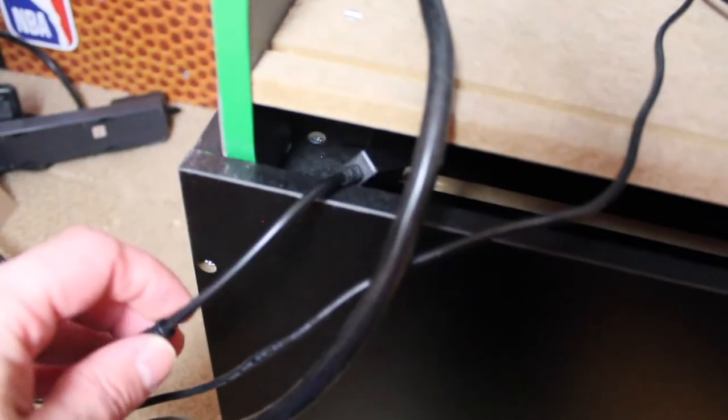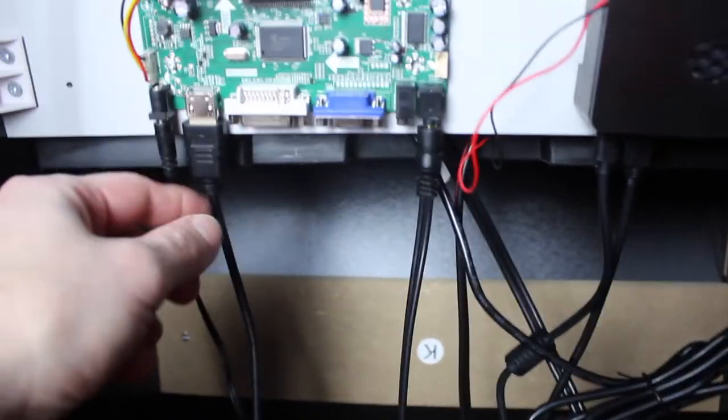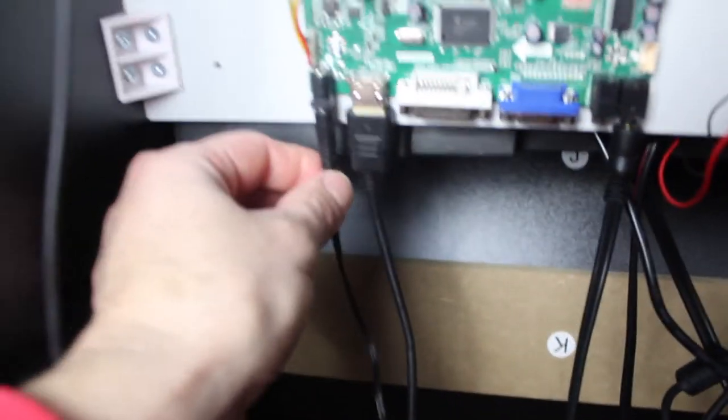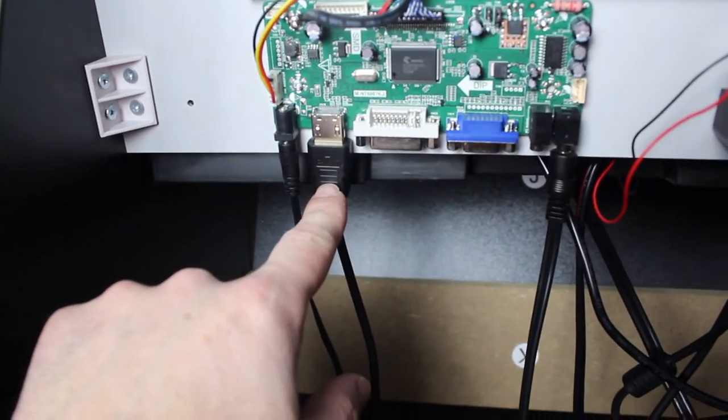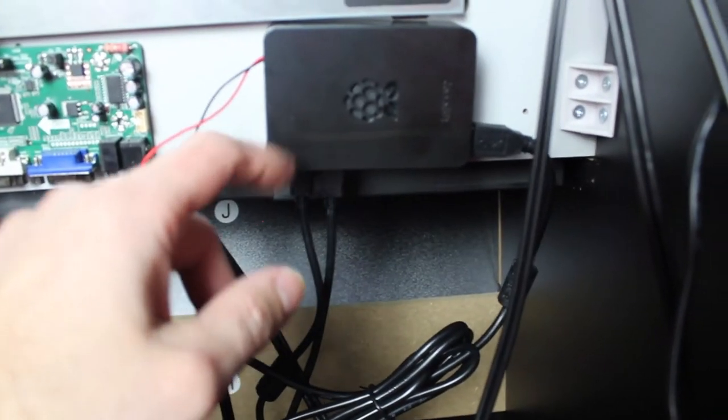Looking in the back — this is pretty similar to ETA Prime's setup. Down here is the cable from the light-up riser and the little display driver board — I'll put a full parts list in the description. Here's the power connection, the HDMI that runs to your Raspberry Pi, and the audio cable that runs up to the amp, which I have mounted up there. Here is the Raspberry Pi 4 — the power cord comes in for the power switch, and you can fit your fan on there as well; it gets a little tight but it works.